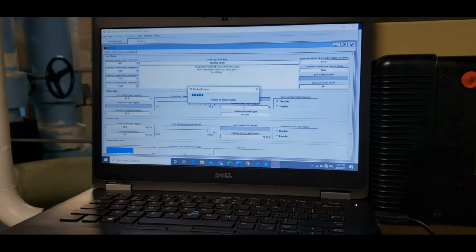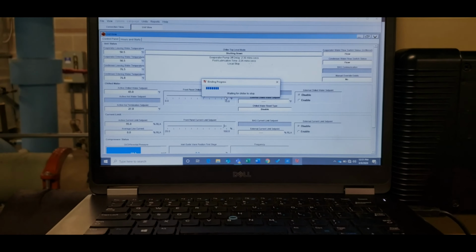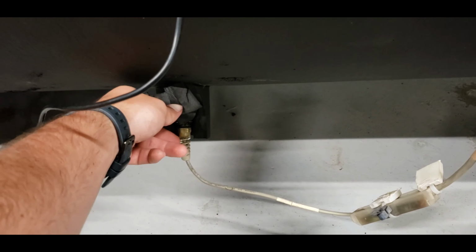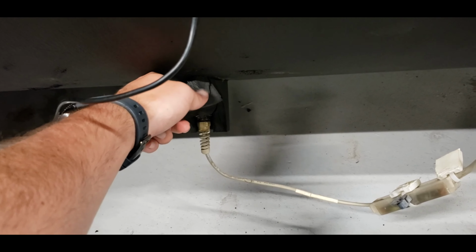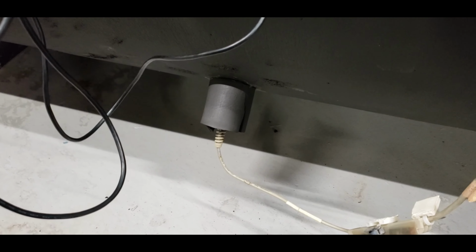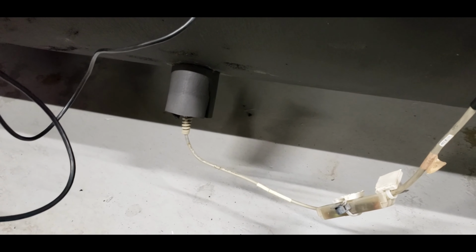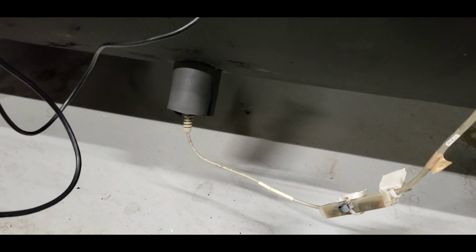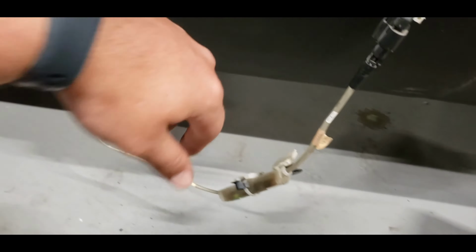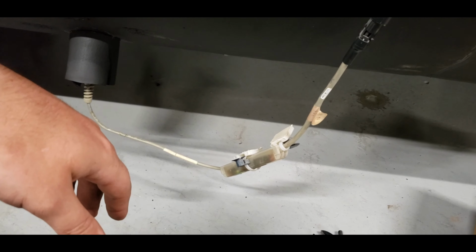Alright, so we're changing out this refrigerant sensor, letting the binding view on the TechView link up. This refrigerant sensor is reading a little off, and it's causing it to register a bad approach value. Well, it's not reading a high approach, it's reading a negative approach. It's saying I've got a negative approach of a few degrees, and that's completely bogus. So this sensor has gotten out of calibration, so we're going to get it changed out and see how she does.